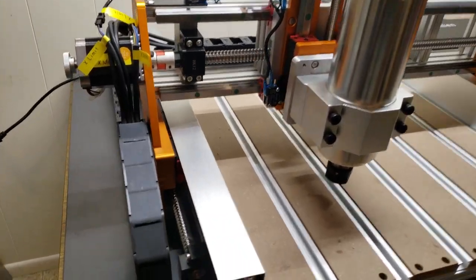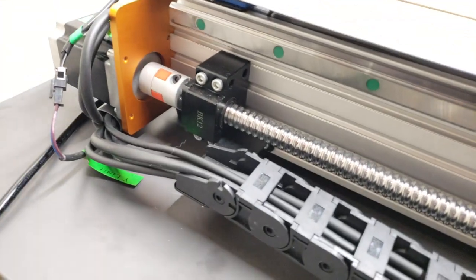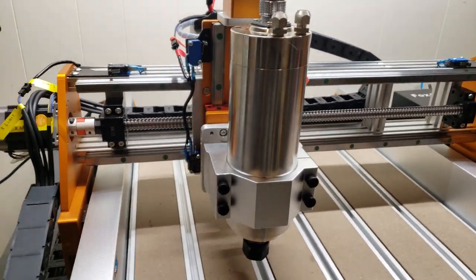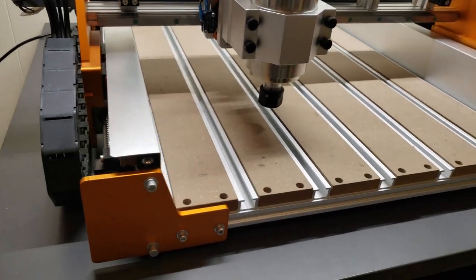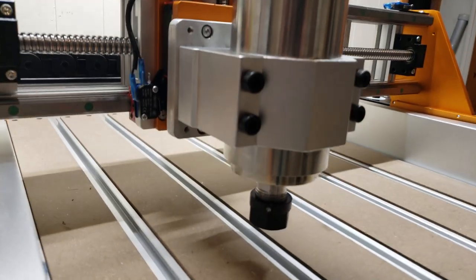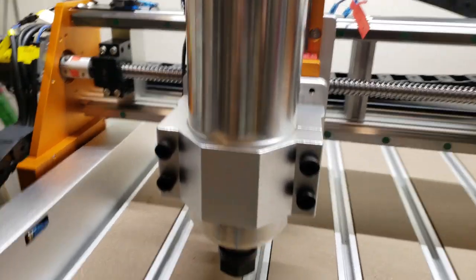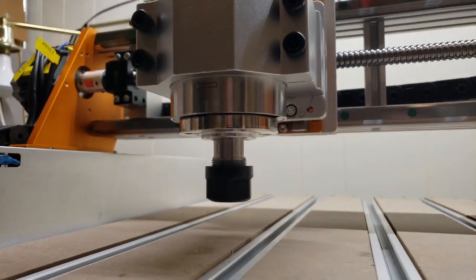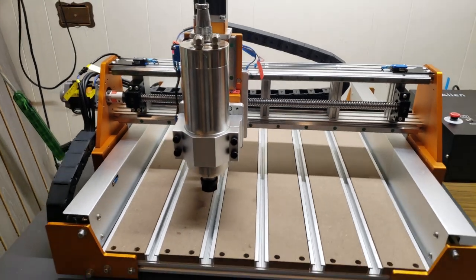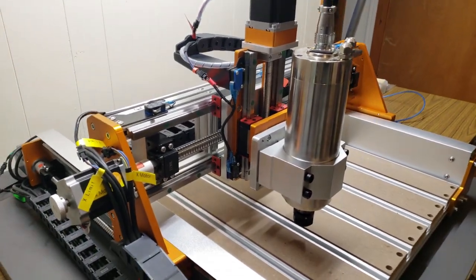I've skipped over recording all the details of the wiring installation — that's pretty straightforward: mount a couple brackets, route some cables, and it all comes together. It's actually been quite a few months since I physically assembled the machine. I've also already invested in the spindle I'm going to test: an 80mm diameter, 2.2kW ER20 collet spindle — probably one of the most appropriate spindles for this machine. It feels like it's meant for it. Next I'm going to wire it up and run some tests, but that'll probably be in the next video.